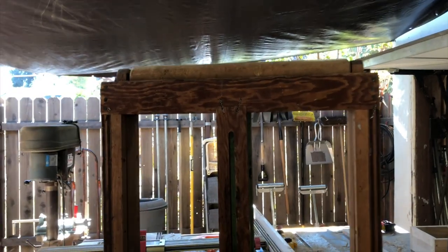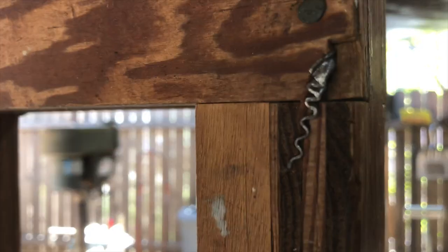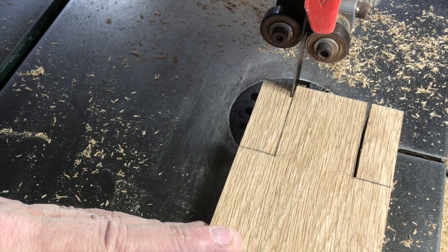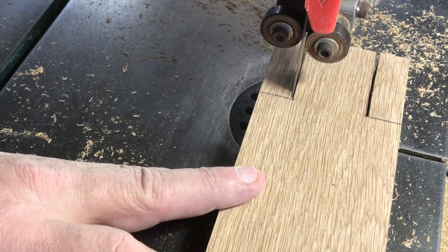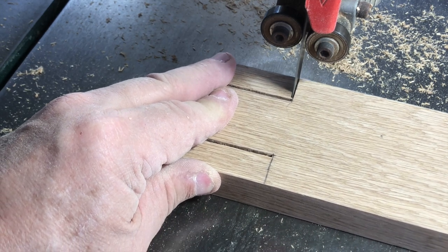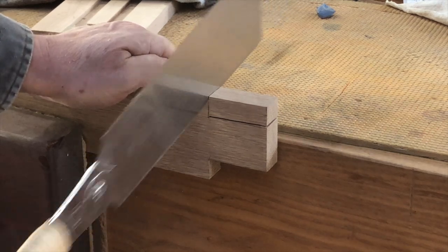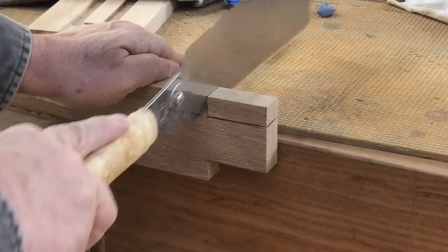When I first viewed this piece in the Craigslist ad, I thought this joint right here, connected by these two butt fasteners, was actually a dovetail joint - that's what it looked like in the tiny photograph. I'm able to do some rather delicate cuts on this bandsaw, so I'll use it for cutting my joints. But there's always more than one way to do it. You could use a coping saw, a traditional handsaw, or a backsaw like this Japanese razor saw. I think these make excellent cuts for joinery - they affect the cut on the back stroke, which gives you great control, and you can make a really straight cut with just a little practice. These joints, once glued and screwed, will be very strong.